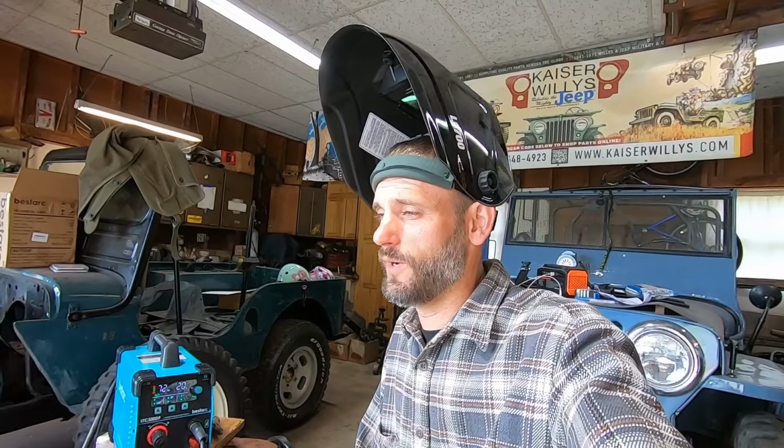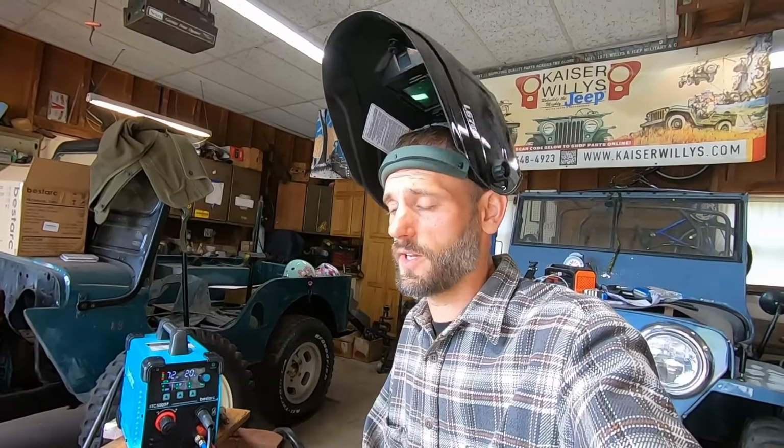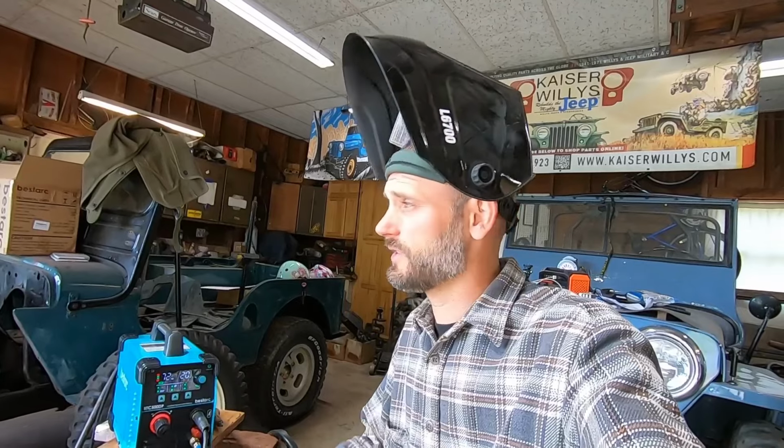You know, MIG welding, you can get by on 110. I built my whole truck bed on 110. I've since moved up to 220, running the welder all the time. But if you want to cut plasma, you need either separate breakers for your air compressor and cutter, or just go right for 220.